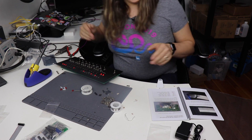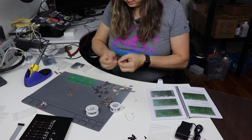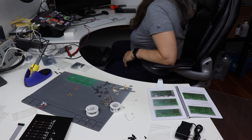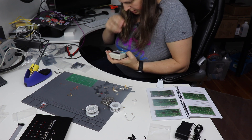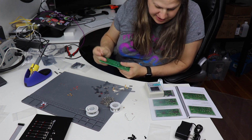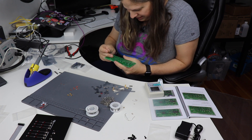We're good. We need to jump ahead because we're doing the IO expansion board next. We need to start by installing the LEDs. Telling these five-banded resistors apart is kind of a pain, so I'm just going to use my magic parts tester because it's easier than a multimeter. It tells me it's a 100k resistor, easy. You can put just about any part in and it'll tell you the exact value — I think it was about 20 or 30 bucks off Amazon. I'll put the link in the description.